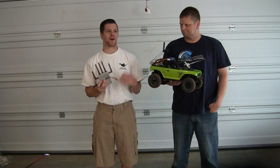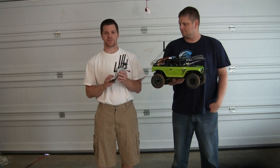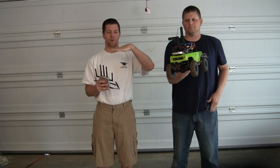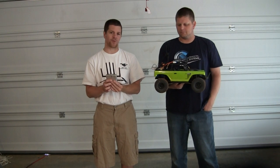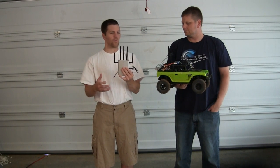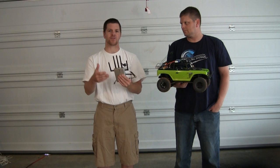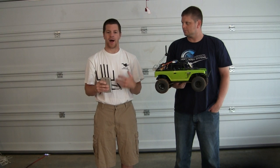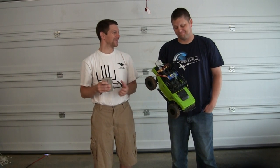We just finished the modified antenna test. We've got the GoPro inside charging — the battery died on us because we were sitting around playing with it too long. Now we've got the system set up with the stock antennas. They recommend you install like this on an aircraft — line one sideways. These are a little bit higher off the ground than our system so it should give slightly better performance. On the other hand, we had 10 dB of link gain with the modified setup: 1 dB on transmit and 9.5 dB on receive — so 10.5 dB total. The stock setup is 2 dB and 5 dB, so we have about 3 dB less gain and would expect a little shorter range.